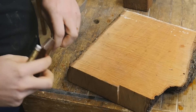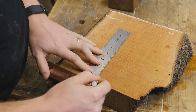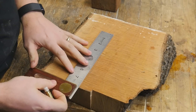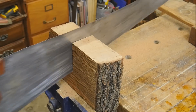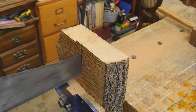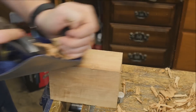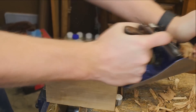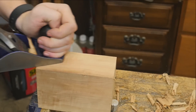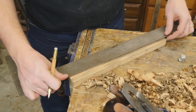Let's look. With the joiner's mallet I made it out of a piece of firewood, but in this case I wanted to use this hunk of cherry that was given to me a while ago. This is actually the same piece of wood I made my leg vise out of, and it is a beautiful piece to work with — about two and a half inches thick. I want to make a block that is about six inches long by about four inches tall, and I'll use a handsaw and hack it out of this board. Then smooth everything down and square it all up so all my edges are true. I have a whole video on squaring up lumber, so I won't go into detail on that.